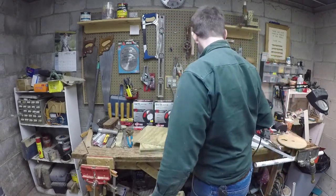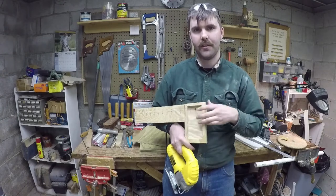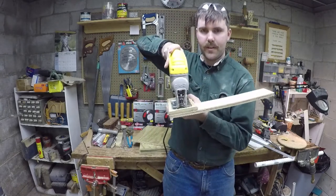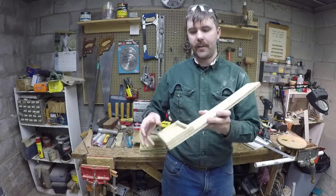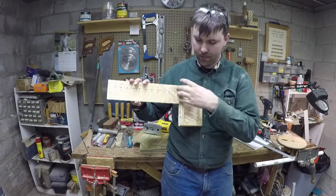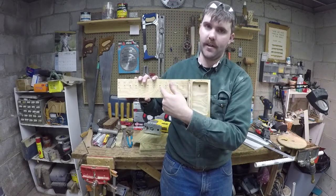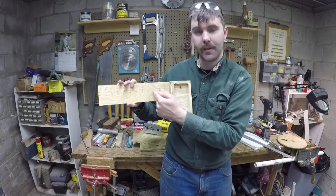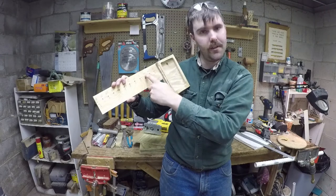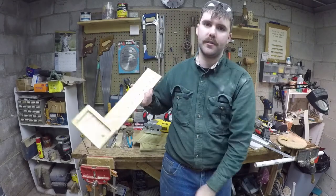For those who want to do this at home but don't know how to make a circle, here's how. I have a circle-cutting tool that I made. Take a jigsaw and cut two pieces of wood — one that fits your jigsaw exactly so it sits in there nice and even, not moving left or right. Then take a second piece that's more of an L-shape, brad it or glue it on, and make sure it sits nice and straight. Measure from where the blade is outward — that distance is your radius, not your diameter. To cut a ten-inch circle, set it to five inches radius, put a nail through a drilled hole on the ruler, and let it guide itself as it drills that circle.